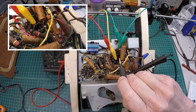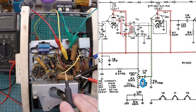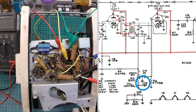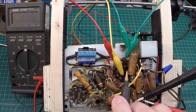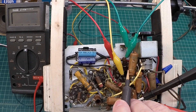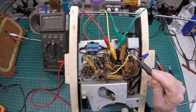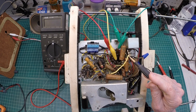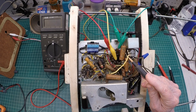Nestled way back in here is C13 — nothing more than an RF bypass cap. The typical range is 150 to 250 picofarads. This looks like it could be a mica or ceramic cap. If this capacitor opens, we would probably hear oscillation. We've been all around the volume control area, and all the checks can be done with a digital multimeter looking at DC resistance. It also acts as a load resistor for the 12SQ7.